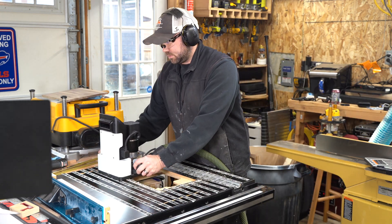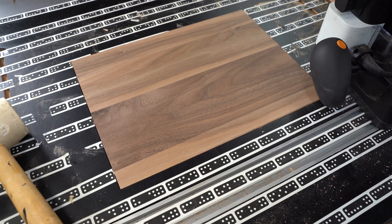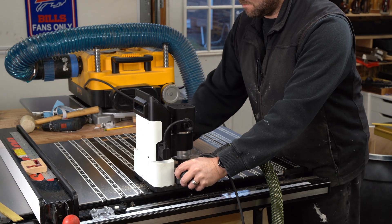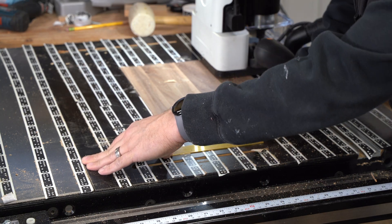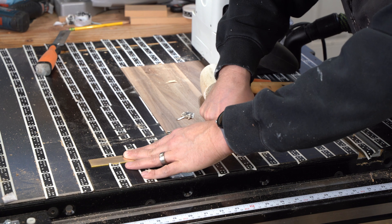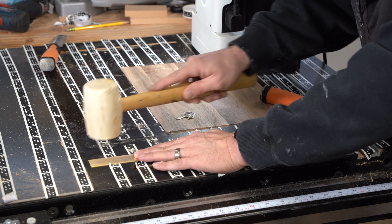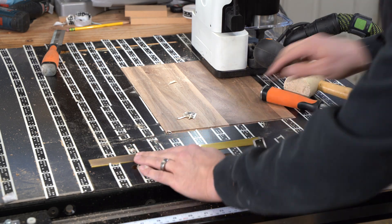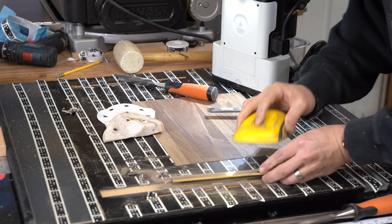When you're a hobbyist woodworker everything's a learning experience, and when you're cutting into your very expensive table saw's extension table to put a router lift in, you want to do it right. If you haven't cut with the Shaper Origin too often, I'd recommend don't make your opening for whatever you're putting in there perfect — give it a little wiggle room, a hundredth or a tenth, so it'll fit well. Otherwise you end up with too tight a fit, which isn't what you want either. Once you've done it, the pieces look really nice and you can sand and buff them to look as beautiful as you want.